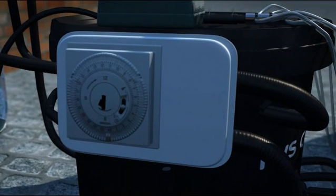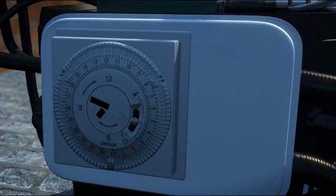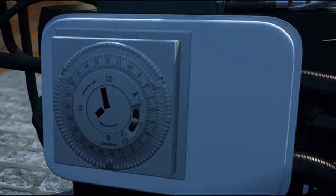The control unit has a 24 hour segmental timer connected to the unit which operates the pumps in both the tank and the control unit. When the segments are pushed out this means the unit is in the fill position. Here we show the timer set to 8 o'clock — when 8 o'clock is reached it will turn the pump on in the tank and fill the control unit.